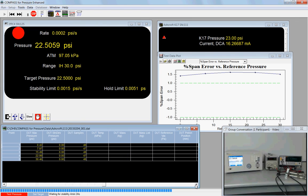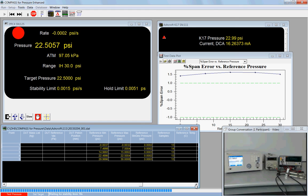And one more note to point out. From a statistical good practice point, for an average to be considered confident, good practice says you need to have 7 or 8 samples for an average. Here we have 13 and 14 and 13. That is good. If one of these test points had, say, 6 or 5 samples compared to the others having 13, that would also suggest a problem. Typically that would fall under an issue with the computer's processor or the remote interface tool. So a few things to keep your eyes open for while running an automated test.